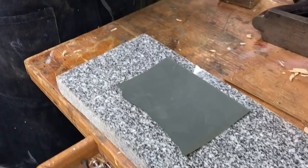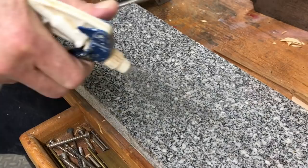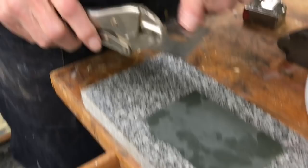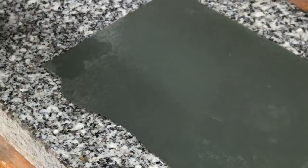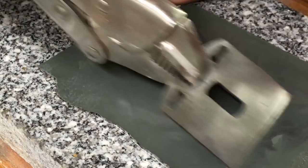I have a lot of diamond stones I use for sharpening, but this is an inexpensive way of doing it. I am not the greatest sharpener in the world. But if you can get a flat piece of granite — maybe at a store that has samples — just wet the granite. I think this is a 2,000 grit — it's probably too fine. You could probably start with four or six hundred and maybe go to a 1,000. You just get different grits of wet sandpaper, probably at any hardware store or paint store.